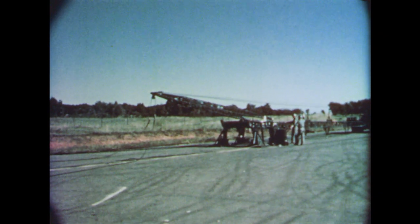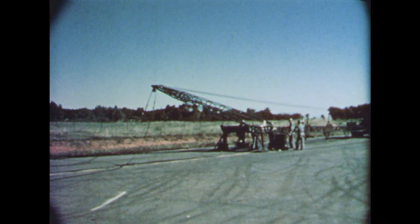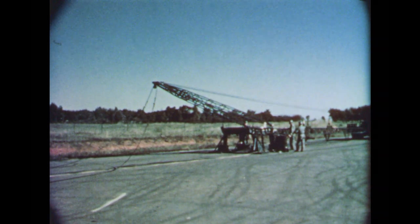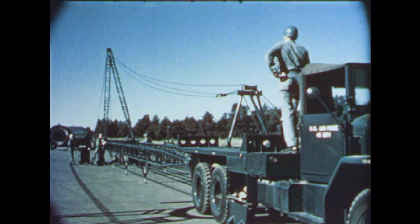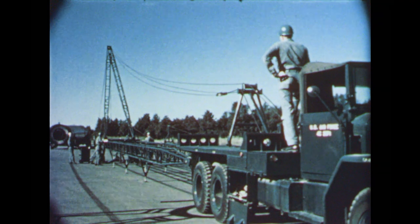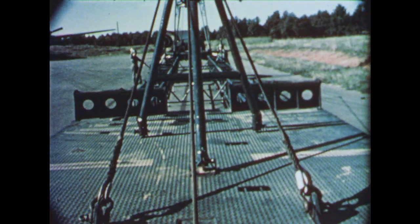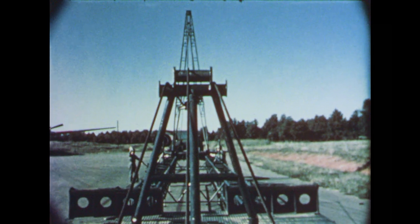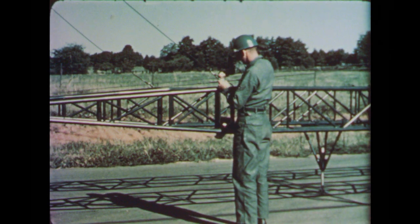As the winch drum is revolved by the erector truck transmission power takeoff, the winch rope tightens, erecting the A-frame. For convenience, the A-frame was assembled and rigged while the frame was horizontal. Now the A-frame is erected to a safe angle before the two positioning cables are attached. Load capacity of the winch is 20,000 pounds. Wire rope speed is variable from approximately 15 to 26 feet per minute.